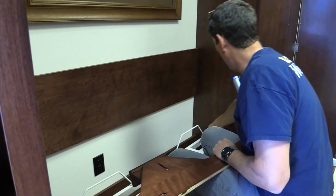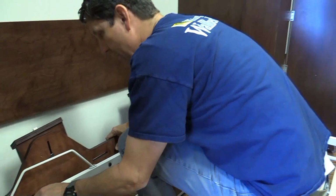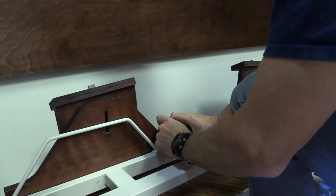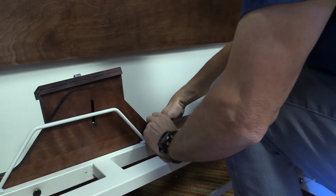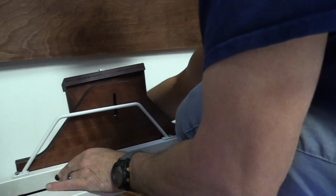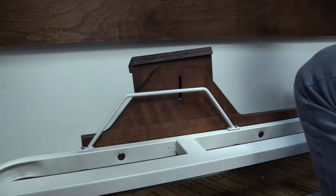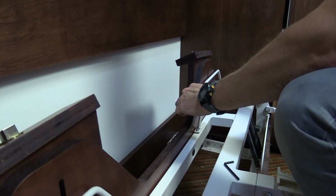1.5 inch furniture screws. They go through the frame there, and they'll go through this slot. There's one slot in each one, and then I'll use the barrel nut, holding everything together there. I'll use the barrel nut and just thread that in, hold it in place, and then I'll go through and attach all of these barrel nuts. You don't want to tighten them down yet. I'm just going to get all 4 in and get them finger tight. The last one.